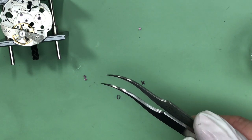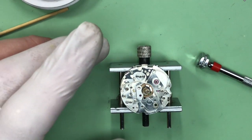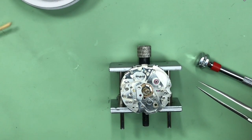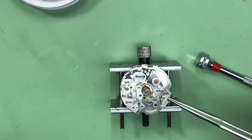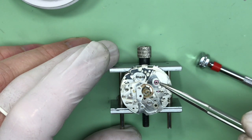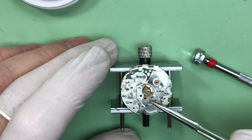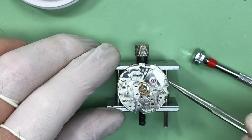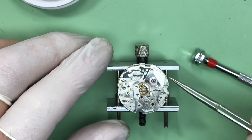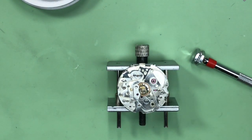Okay, keep going. Just a quick update. Your chronograph wheel is great, like I said. Starting now to assemble the train bridge. Here's your upper mainspring arbor port jewel. Now start to assemble the chronograph components, but to give you a sense here, this is not under any power, but everybody's running beautifully. So we're on our way. Got some lubrication to do and some pieces to build.